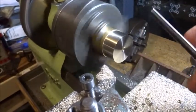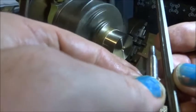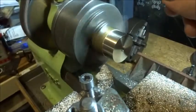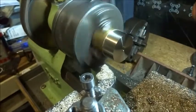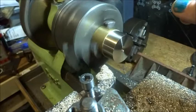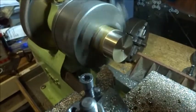Now this tapered pin reamer is quite long, and if we look at where it intercedes, it's right back up here before it'll even cut anywhere near where it's going to fit. So what we need to do is part this off and set it up. In hindsight, I probably should have left the crank disc off the crank until we finished the flywheel — that way I could set it up with a drive dog and drive plate on the centre and get it all machined up nicely.